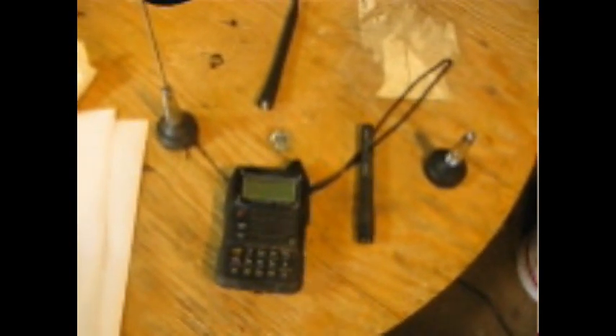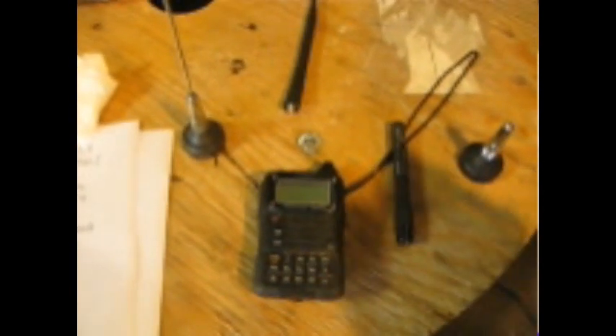The next service is the General Mobile Radio Service — GMRS. It has eight unique channels plus seven shared with FRS. This is the band I'm personally looking into. The beauty of it is you're allowed up to 50 watts of power, so in your mobile or home station you can get a radio capable of transmitting 50 watts — that's a good amount of power for that application. You do need an FCC license, but no testing is required, and then you're street legal to use the full 50 watts.